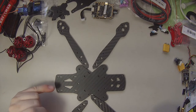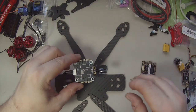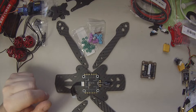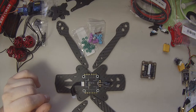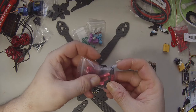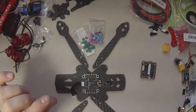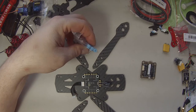We're going to custom 3D print a TPU mount for that camera once we get to that. For our 4-in-1 ESC we've got some gummies and some standoffs that we're going to use to make our stack. We're going to use a solid bolt all the way through instead of the little nylons that came with the frame. We'll run one bolt all the way through with gummies to keep everything separated — choice of pink or blue.